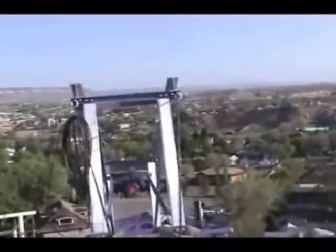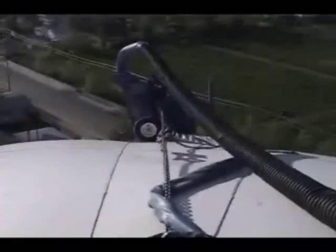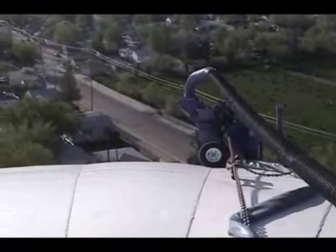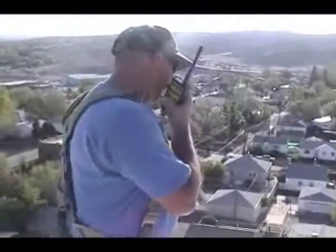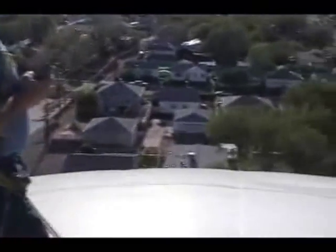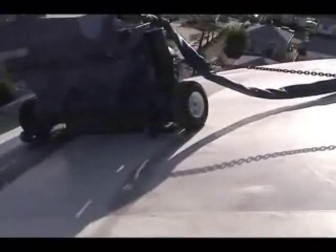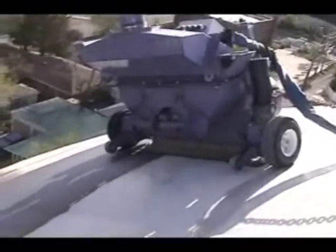There is little or no shot leakage around the seal. This cleaning process is the most cost-effective method of surface preparation. The cost of the shot is minimal compared to the tons of sand, copper slag, or black beauty required to clean this tank in the conventional manner. The cost of major containment has also been eliminated — only small containment is used to complete the minor cut-in areas that the machine can't clean. And there is no cleanup required.